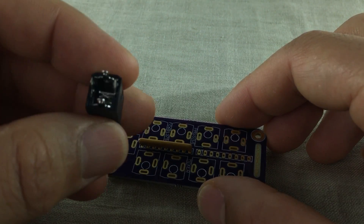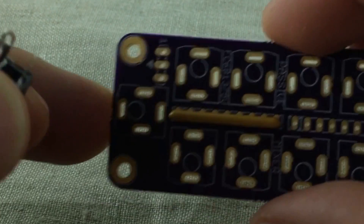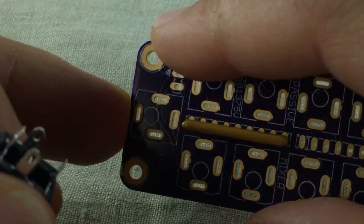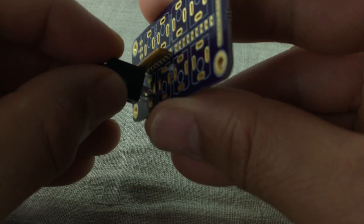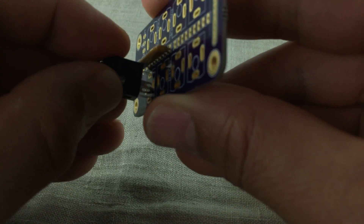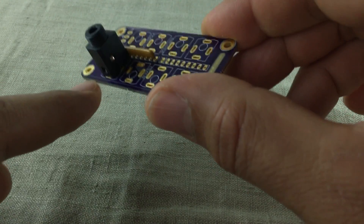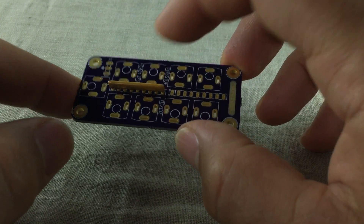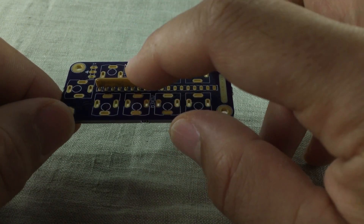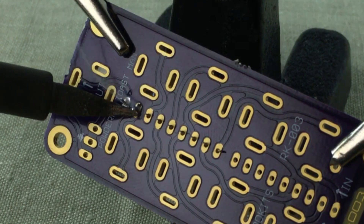You've got nine of these stereo connectors and they also have an orientation. If you look closely, they have a beveled edge on one side, and if you look at the silk screen on the circuit board, the beveled edge goes towards the outside of the circuit board — it's the same for all of the jacks. These can be a bit tricky to fit in because they've got four legs. The beveled edge points away from the center of the circuit board. I do suggest that you solder the resistor arrays first because they're so tiny — once you've fitted all of the headphone connectors, you won't be able to reach them. I'll put a link in the description to a page where you can read about how solder should look, and I also suggest watching some YouTube videos on how to solder if you don't know how.